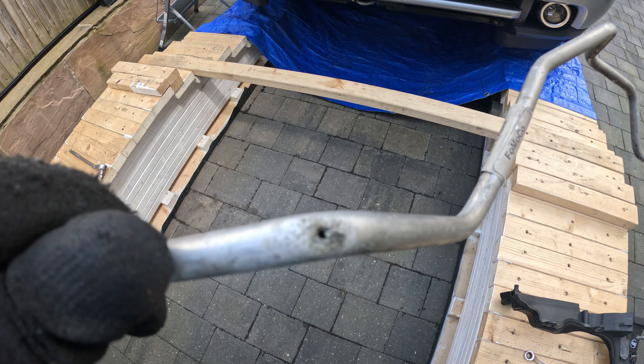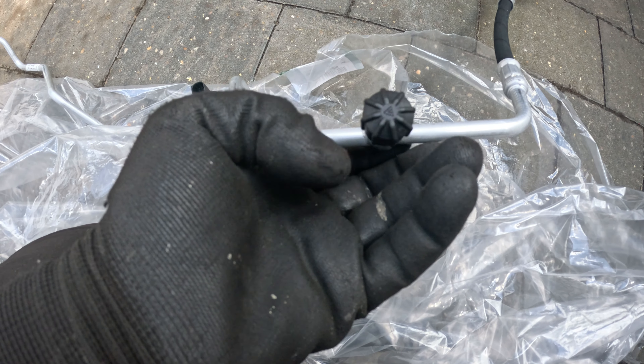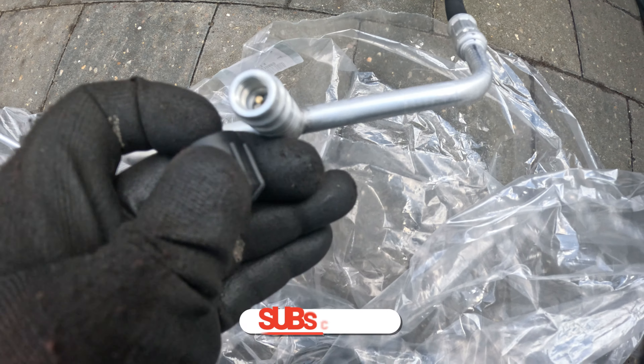There's a big hole here. You can see the manufacture date, which is as old as the car — 17th of June 2009. In case you wanted to do this job, the new part comes with its own sensor, the valve, and the Schrader valve for the high pressure side. It also comes with rubber seals on both ends. I've put the pipe in and the screw back. All trims are back. I also managed to buy new screws for the radiator — you can't buy individual ones, you have to buy a pack of 10, and I'll show you the part number.